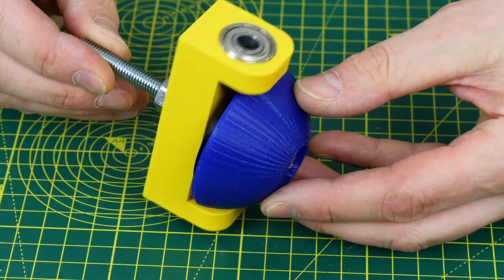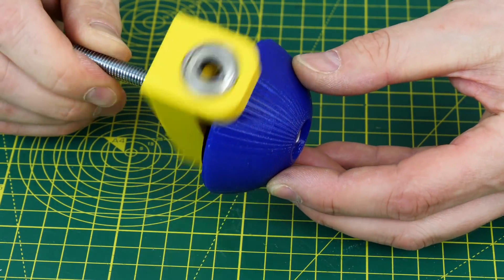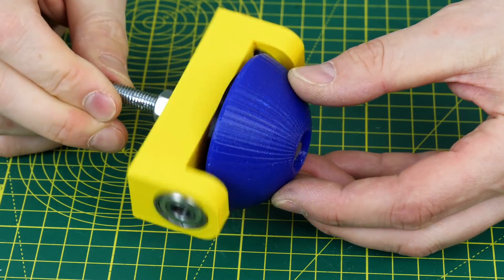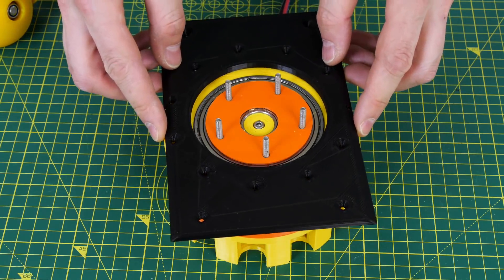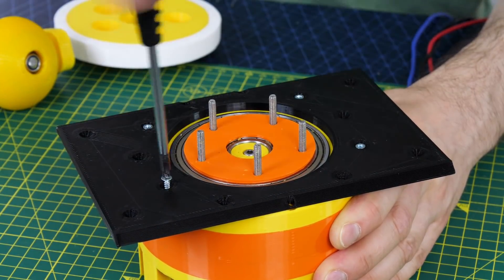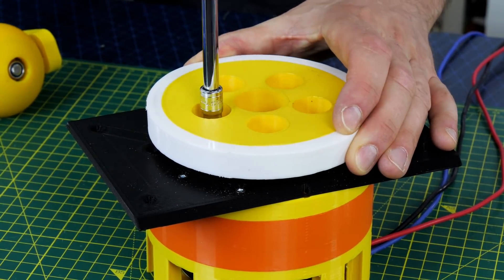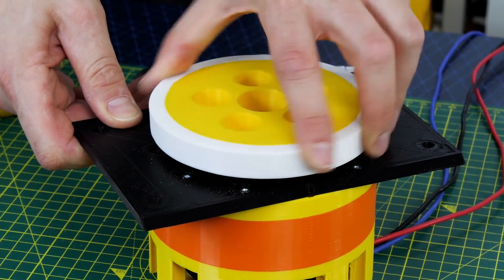Each hemisphere is actually slightly less than half a sphere, but the pivot point is in the middle of where it would be if it were a full ball. I found my cycloidal drive version 2 exactly as it was since I tested it with the skateboard — you can check that video out on my channel. That's mounted onto a plate and we've got a wheel on there with another TPU tyre, which is the white part around the outside of the yellow.